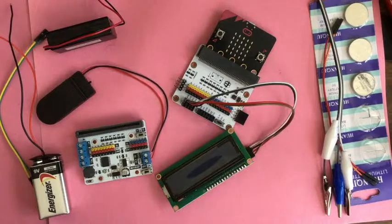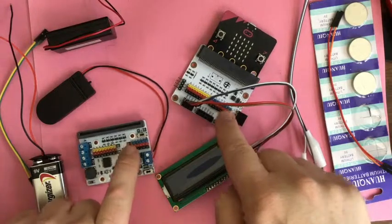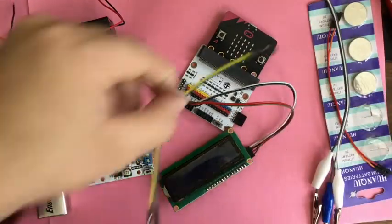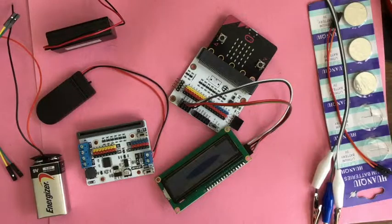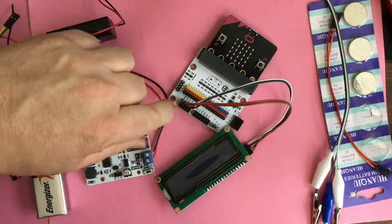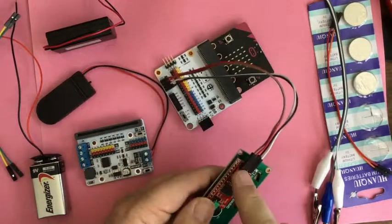As with all breakout boards, you need an assortment of wires. Obviously some female ends because there are male header pins here — female to alligator clip, female to female. And these are female to male because the signal connector is a male input on that side.